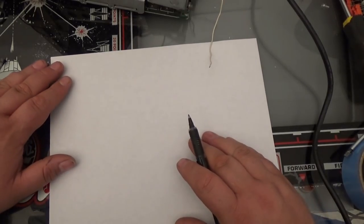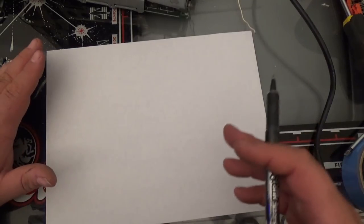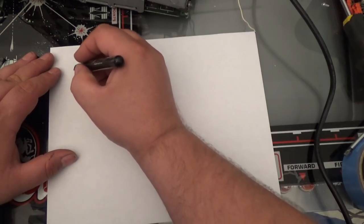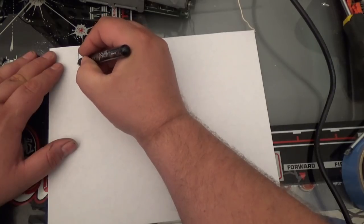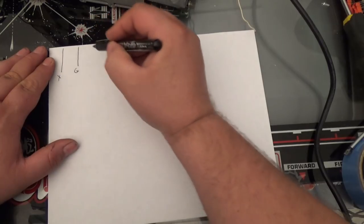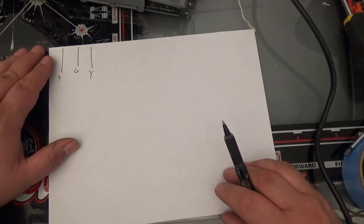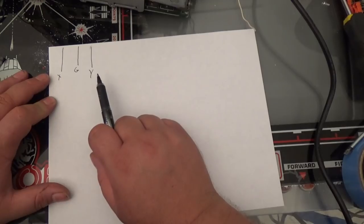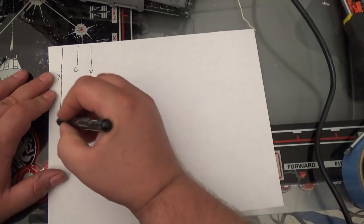What I'm going to do is, under normal operation, the deflection coil is moving, correct? I mean, it is being powered, correct? The deflection coil has three wires. There's four wires, but it's basically three. What it really is: a ground, an X, and a Y. Okay? And so what we're going to do is, I'm going to sense the X and or the Y for an input.